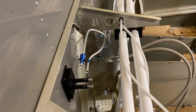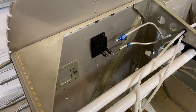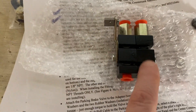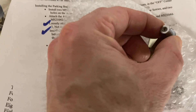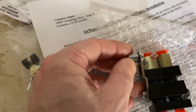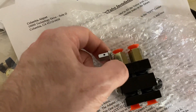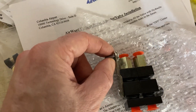On the other side, you get the six rivets plus these two holes here, which get sized to take screws that go into the back of this unit. So the next thing for me is to get these nut plates riveted in here and then attach this onto the wall. This is the actual valve, and you have to attach this cable nut clip onto here. It's got a set screw to set it. Reading the instructions, it seemed like you put a washer on this side and a washer on that side, and then put in the cotter pin.